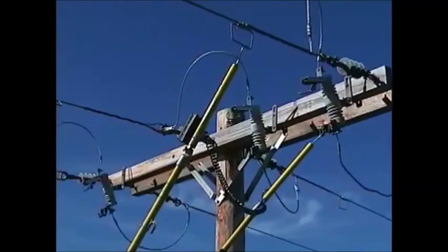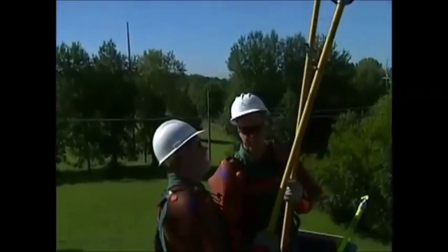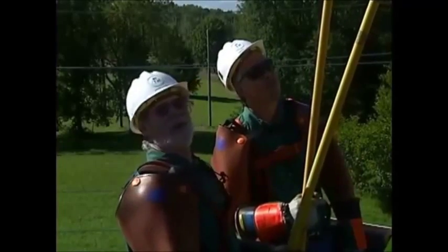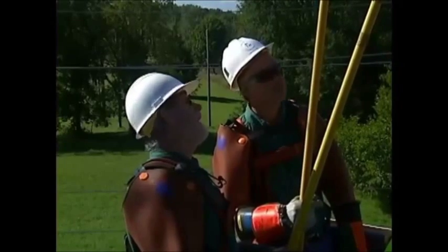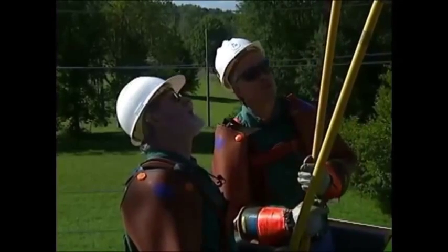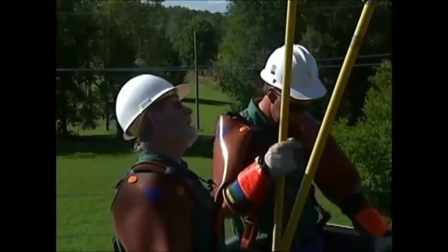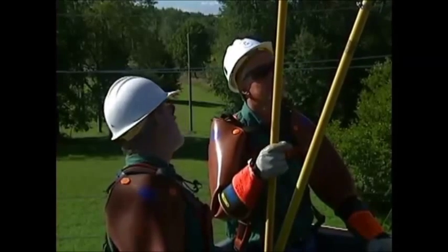On a lot of feeders, when you've got small wire coming out of a substation on a heavily loaded circuit and one side of the switch is large wire close to the substation, it's conceivable you can have a fairly high reading on the same phase but still go together. I've seen 500 and 600 volts on distribution circuits. That's the difference with a digital meter versus an analog — you actually see the voltage where with analog it was just a small needle swing.